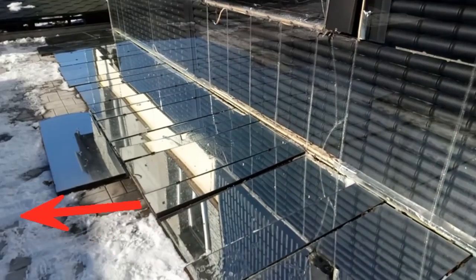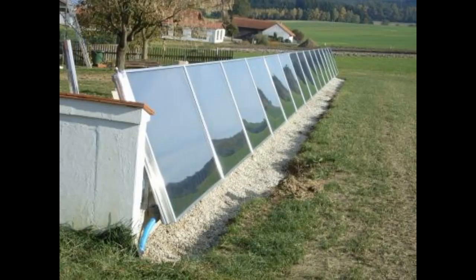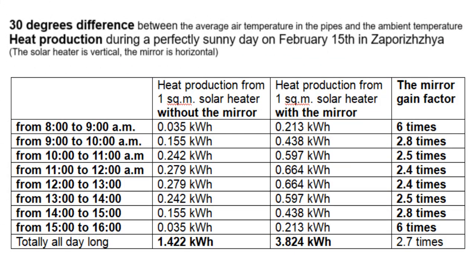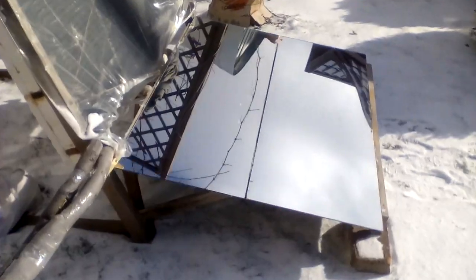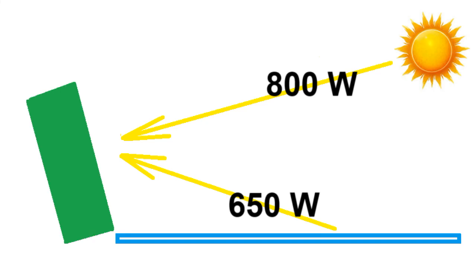South should be there or not far from that direction. The reflection of the mirrors in the morning will not cover this corner, and the evening reflection will not cover this corner, but my calculations did not take these facts into account and assumed that the row of solar heaters was very long. Adding mirrors will increase the air temperature at the outlet of the pipes if we refuse to increase the air flow through the pipes by two or three times during the use of the mirror. Increasing that temperature will slightly increase heat losses. My calculations were for the same average temperatures for both the case without and with the mirror. The mirrors cover some snow surface that would otherwise direct solar radiation into the solar heaters, but approximately ten times less compared to the mirrors. My calculations were for a vertical solar heater with a horizontal mirror, and increasing the angle of inclination of the solar heater reduces the mirror gain factor.